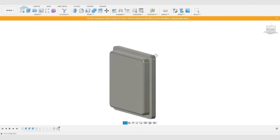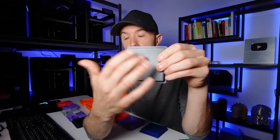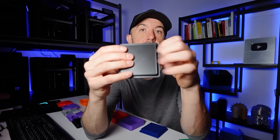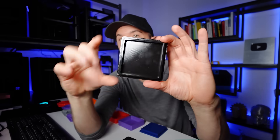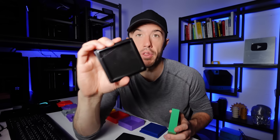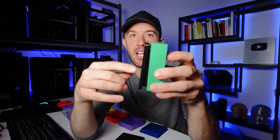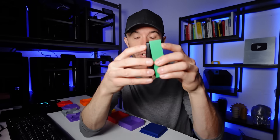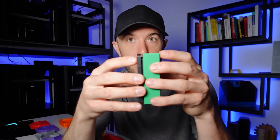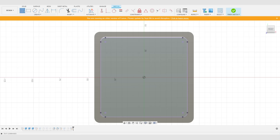The problem with a solid inner base is potential shrinkage — depending on infill direction or type, the sidewalls can vary slightly. To adjust for that, go to a thin wall: just cut out the inner cavity. This gives a little more flexibility if walls are made really thin, and reduces the opportunity for infill to affect the dimensionality of your part. The walls will always be solid, giving you much more reliable dimensions, because shrinkage is reduced compared to the fully solid version.